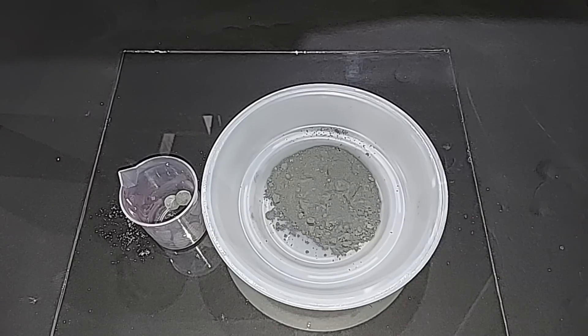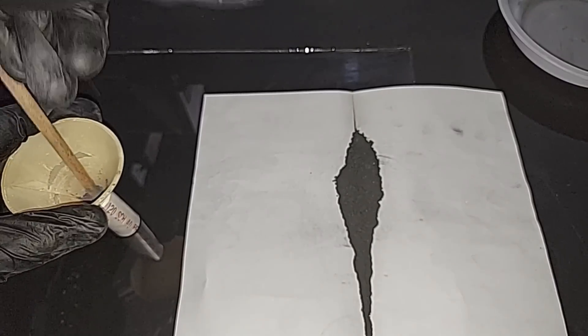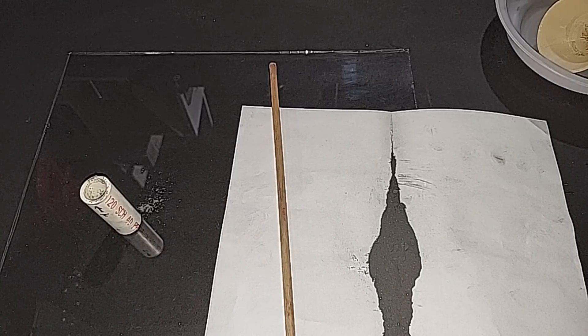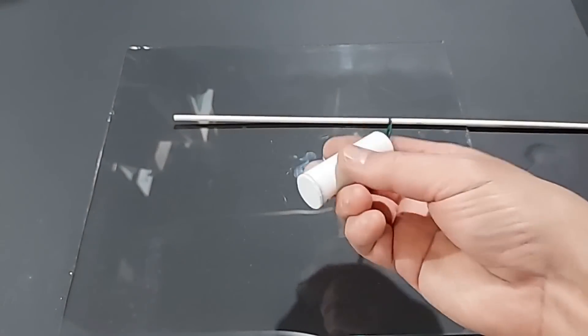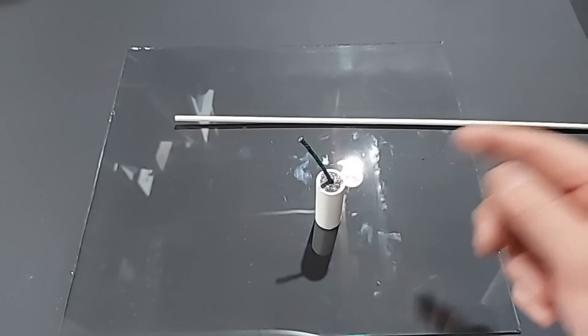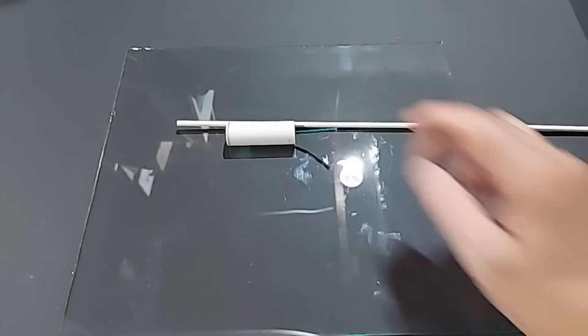New mix loaded — let's see how it does in the rocket engine, same packing process as before. I pack it to about 3/16 of an inch from the top and fill that in with putty. I kept the end cap and drilled the hole — it's set to go. That's a 5/32-inch hole; I usually do 9/64ths, but considering how catastrophically the last one failed I wanted a bigger nozzle. Maybe too many changes at once — we'll find out.